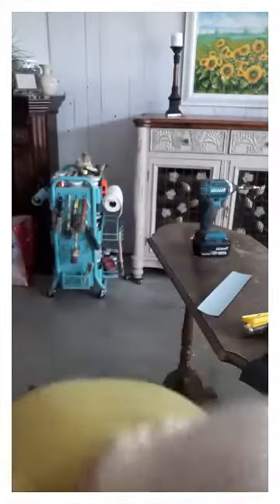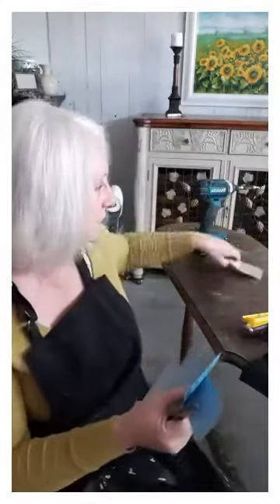When I was doing some chairs a while back, they had a lot of dowels and I was really getting sick and tired of trying to get the old paint off. I was thinking about a shoeshine — my husband once at the airport in Vancouver and the shoeshine lady — and I thought that might just work. So I actually cut a piece of sandpaper long off a sheet and started doing this shoeshine method around my dowels. It actually works really fast. In other areas I'll just take a piece about three inches wide and five inches long and use that on other parts as well.